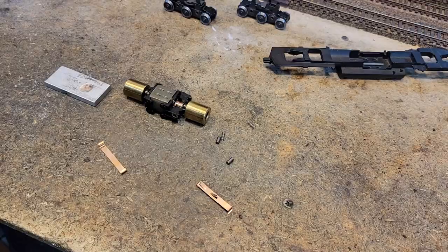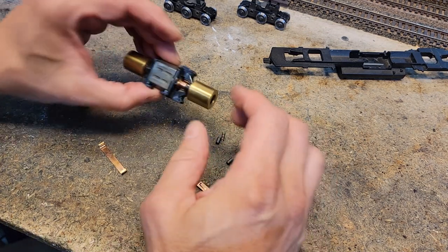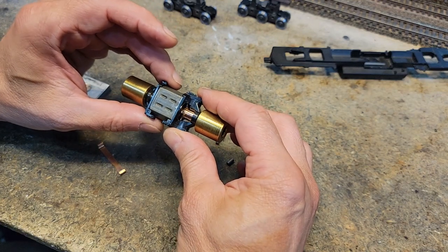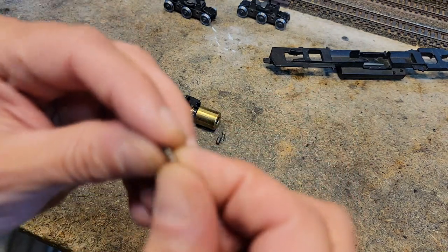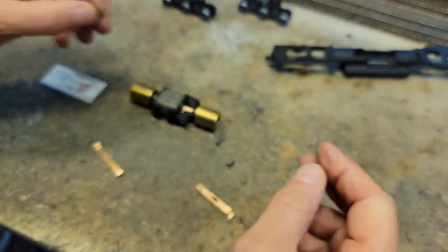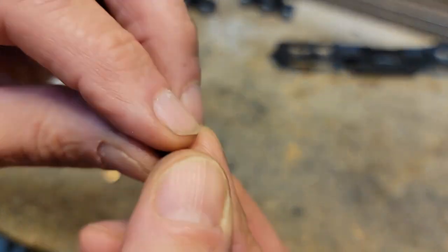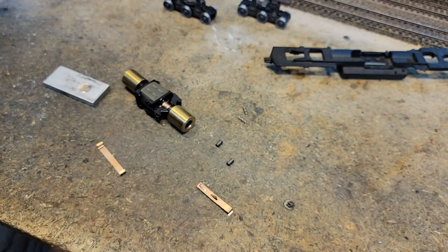Here's the motor that came out of this blue box. I'm not putting this back in, but I am going to tune it up. So I'm taking out the brushes and the springs — these springs to me seem kind of strange. They have an awful lot of coil in them. It seems to me they should be phosphor bronze but they're not. I think this is a more modern motor.